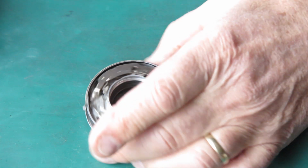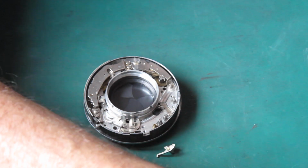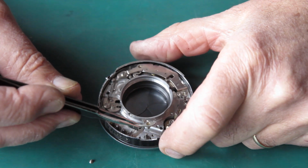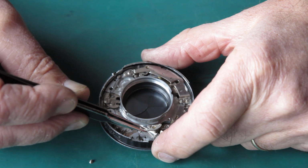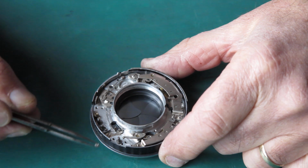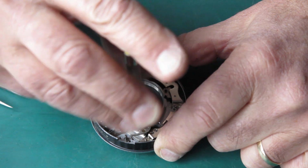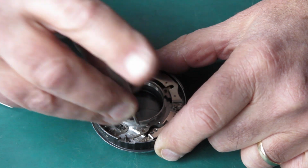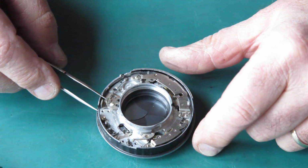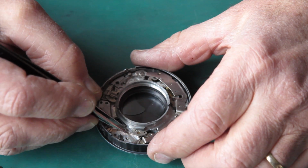Right, start putting the other gear back into the shutter. Oh, I think we can probably start with the latch. All of these different levers have their own particular screw, so it's important that the correct screw goes with the correct item. If you're unsure, if you've been interrupted partway through a repair so that parts have become scattered, you always try them on the mechanism plate before you assemble the shutter like this, to make sure the screws don't stick out the back where they'd catch on something.